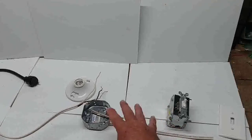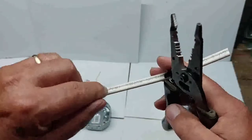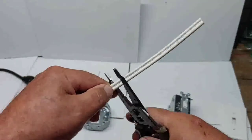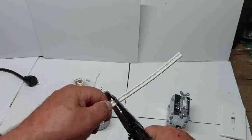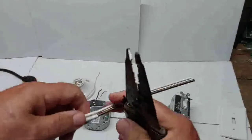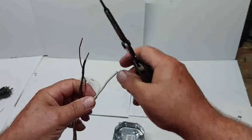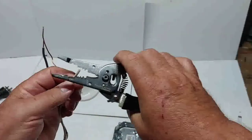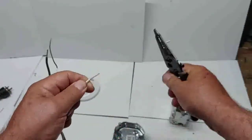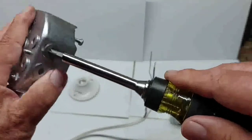Just a short piece of wire in here so you can see it easier. Using the Croc pliers and cutters to cut the sheathing off. Power is going into the light first. I already cut the end on the black wire, so just cut the end on the white neutral wire here — need about three-quarters of an inch.